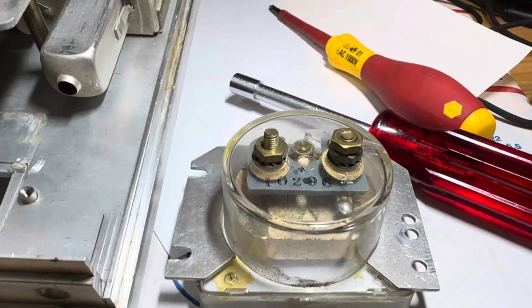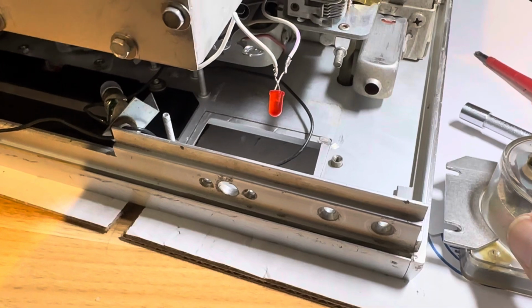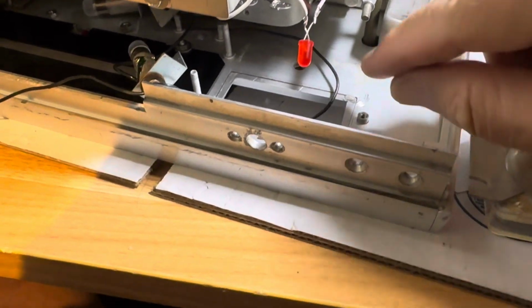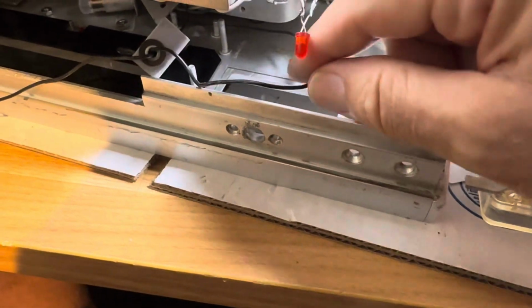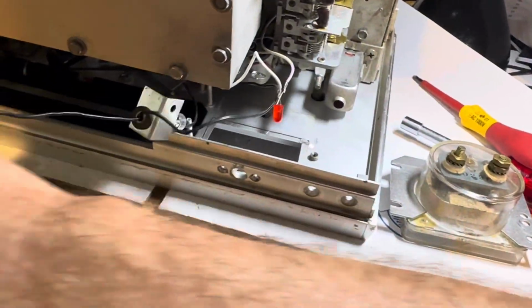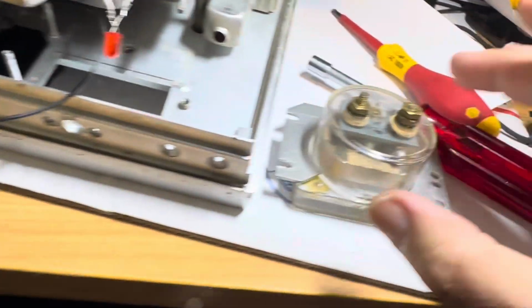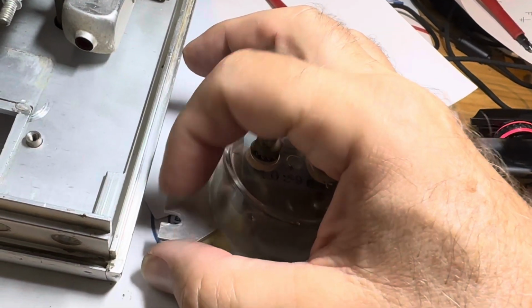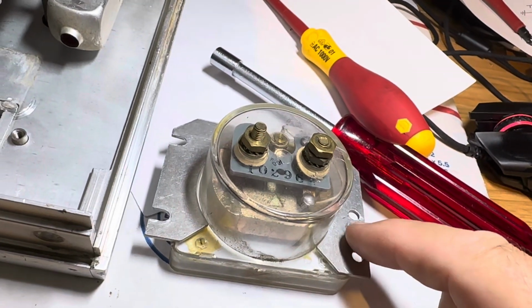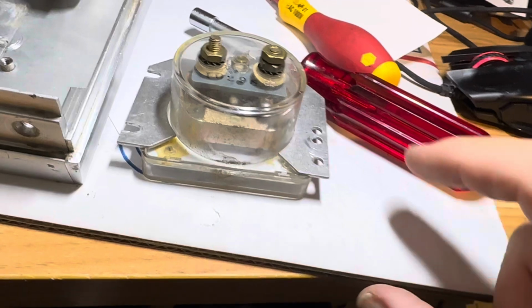At any rate, there was some folklore that you have to remove the front panel to get the meter off. Well, I didn't remove the front panel, and it was painful to get the meter out, so I'll detail how I did it. The first thing you do is, of course, you take out these two nuts and take out this screw that holds the light bulb. The light bulb screw goes into here, and that screw goes in through here.